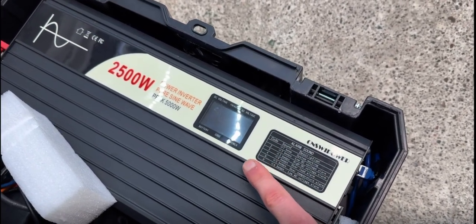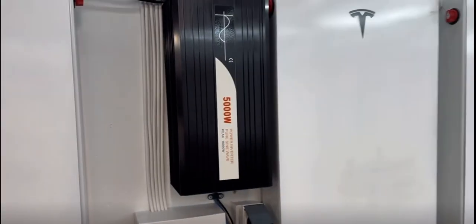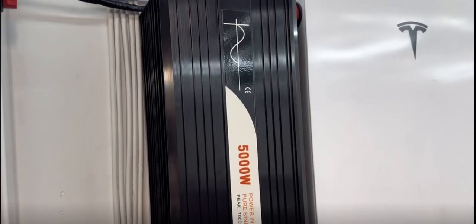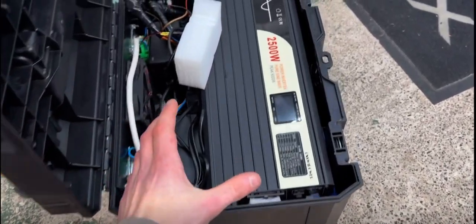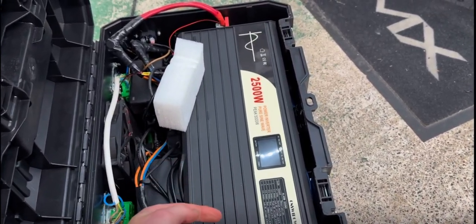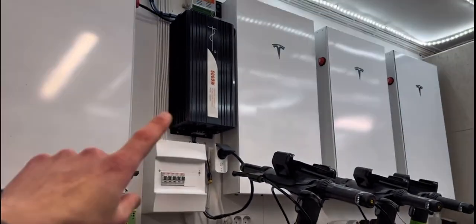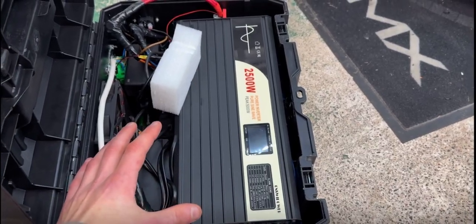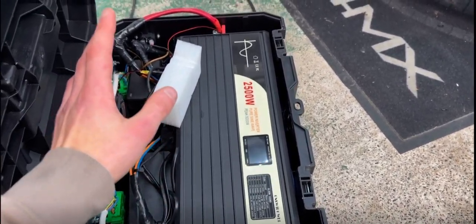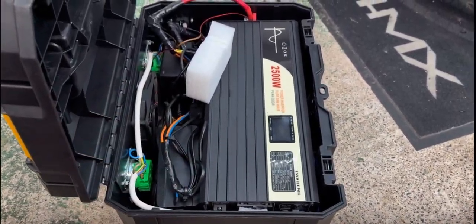If you're building something like this, I would highly recommend inverters from this brand — I've had them for years, I've had five of them, and they've never broken. I recently upgraded my solar system using a 5000-watt inverter from the same company and it works very well. Just keep in mind: if you're going to use this power station 24/7, check how many watts it draws on standby. This one draws around 20 watts, but that other inverter uses 60 watts — that's like 1.5 kilowatt-hours over 24 hours, which is a lot. If you're only using it occasionally, go for the biggest inverter that fits for maximum flexibility.